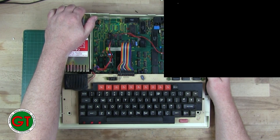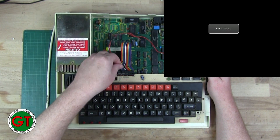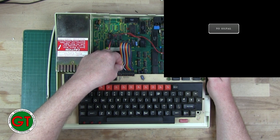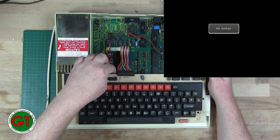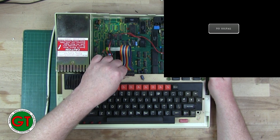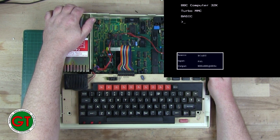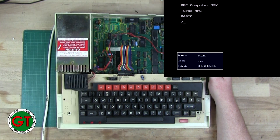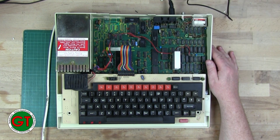Once I figured out that there were several connectors broken on the ribbon cable, I put this on here in its place. This is just some Dupont connectors - it's way too long for individual ones so it's a bit of a pain, but it does the job. The computer switches on, we have our cursor, and we get BBC Micro Computer 32K coming up.